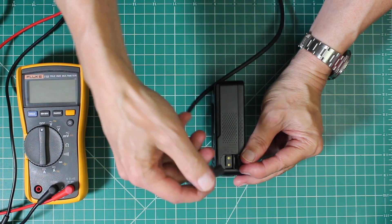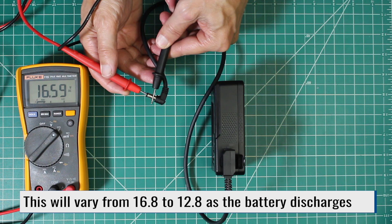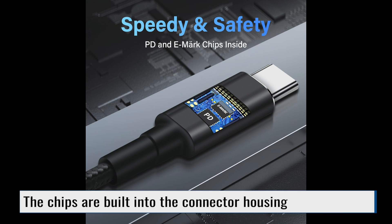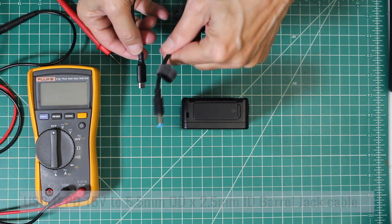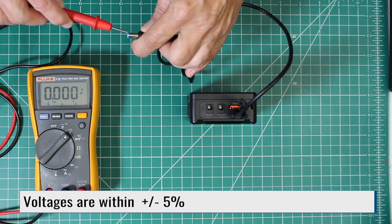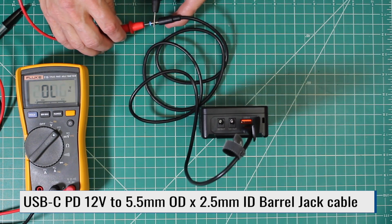We're fully charged. Let's test out the D-Tap. This is a D-Tap to a barrel jack cable - we're center positive. And we get 16.59 volts. This is great for a Jetson Orin or Xavier. For devices that do not have built-in USB-C PD, you can get what are called trigger cables. Trigger cables have a built-in power delivery and eMark chips, which negotiate which voltage will be delivered to a device. This enables use with a Jetson Orin Nano or Xavier NX, which does not have built-in USB-PD. This is a 15-volt trigger cable. Let's plug it into the USB-C port. Center positive - and 14.96 volts, as we expect. If we use a 12-volt trigger, we get 11.98 volts.